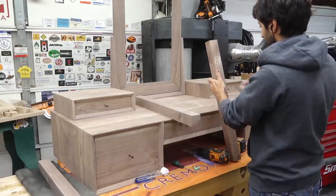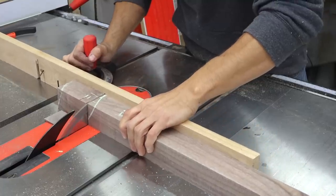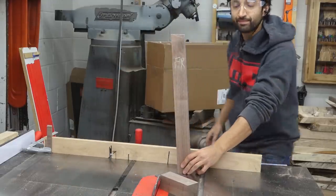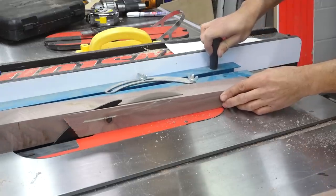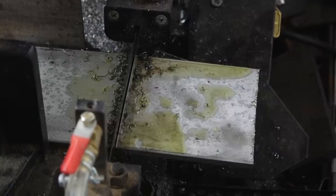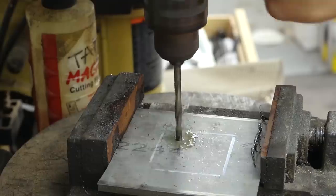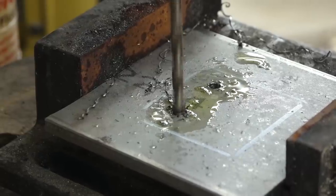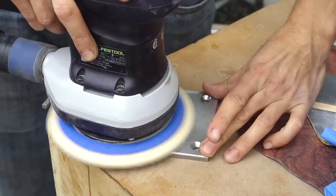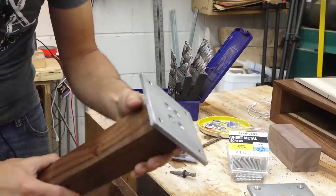The last bit of construction is to add the legs. These have a compound splay, so I made sure to mark each leg really well so I wouldn't make a miscut. With the blade tipped and the miter gauge swung, the two parallel cuts can be made on each leg. Next, I'll add a taper to the inside faces of each leg. Now for some way to attach them — I'm making some mounting plates from stainless steel, because I like challenging materials apparently. I'll lay out a pair of four holes: the outer holes will attach the plate to the case, and the inner holes will attach the leg to the plate. The holes are countersunk on opposite faces. I'll give them a quick cleanup, then mount them to the legs with the four middle holes. Now the legs are ready to go on once the case is finished.